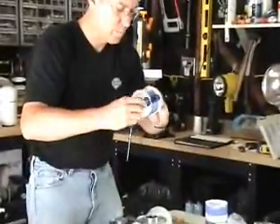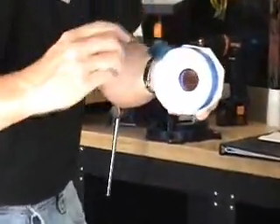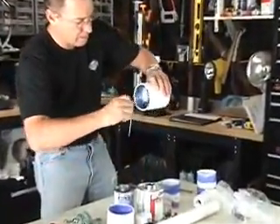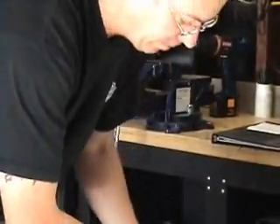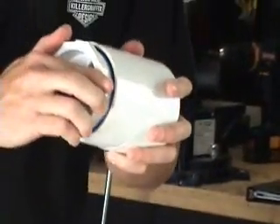You're going to want to put on a pretty liberal amount of glue because we don't want this thing to leak. I goop it on there pretty good all the way around, and my trick is I do both pieces. That way, if there's any missed part in there, the little extra glue will get it. With both ends with glue on them, I put it in and I twist as I put it together to make sure I get a nice seal in there.